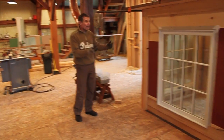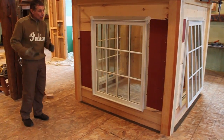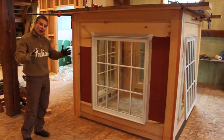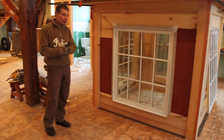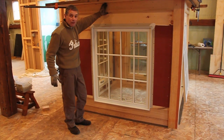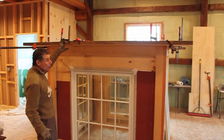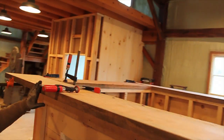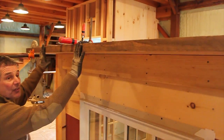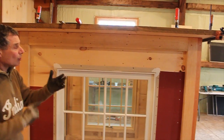Here in the classroom, this is component number two — the main body of the cupola we're building for this barn. If you remember the video already up on YouTube, we constructed the base which is turned 45 degrees from the traditional way. The main body is five feet eight inches tall. This here is the base of the steeple roof — these are 2-by-16-inch white pine planks that we clamped and glued together to become the base of the church steeple.